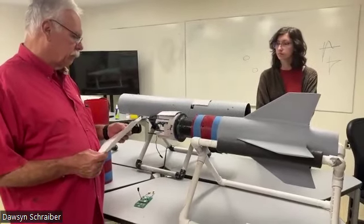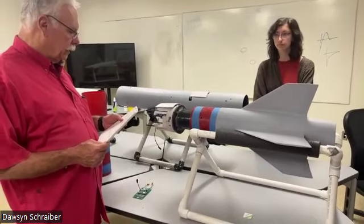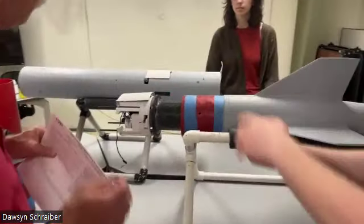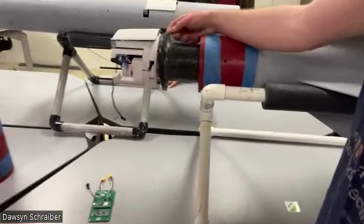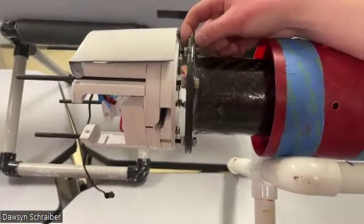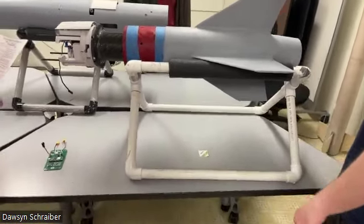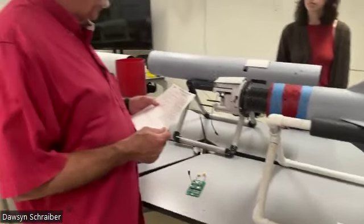Motor tube material? Carbon fiber, yeah, that's right. Okay. Centering ring material? Also carbon fiber. We make plates out of cut off material, and then we water jet out rings. You can see here, these are 2 rings stacked on a bulkhead up here for a lot of thickness. There's a couple rings in the actual fin can structure as well. Okay, motor retention is SRAD, and you have that.